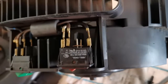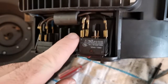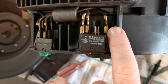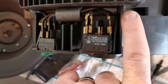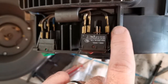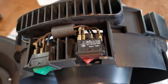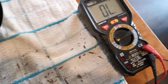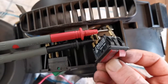I'm suspicious of this switch because it's not doing what it should do. You've got two contacts here which are both connected to each other, and then one over here. These two in the middle are connected to each other - that's fine, we can ignore that. What we should see is continuity between these two terminals when the switch is placed into the momentary position. The terminals are connected and we're on beep mode for continuity - and we're getting nothing.